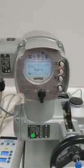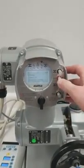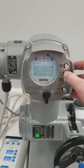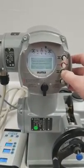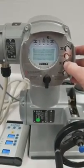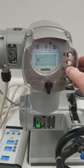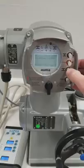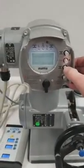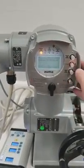You set the controller to the off mode, then hold down this button to go into programming mode. Go down to customer settings and then go to limit switching. You want to set position open or closed — set closed. You log in as a specialist by default and the password is just all zeros. Now it's telling you to position it closed and then hit enter. So I'm just going to hit enter. Now it's indicating that we've set the in position closed.